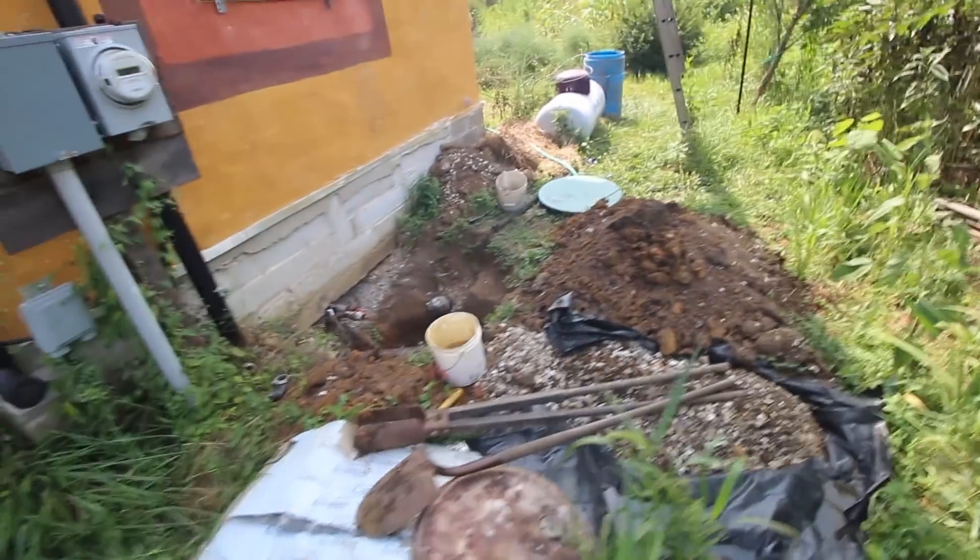If we hadn't had cold temperatures causing freezing damage to things like my water filter, I wouldn't have suspected a crack. But that's the problem — you have issues on top of issues, which confuses the troubleshooting. You have to be like a detective, figuring out what the problem is and anticipating things you've never seen before, like a foot valve sticking. That's probably what it is, so I'm going to have to go down into my cistern and manually loosen that valve.